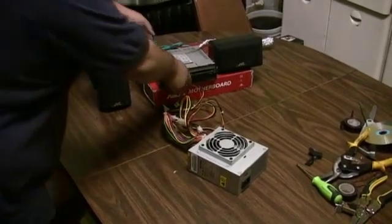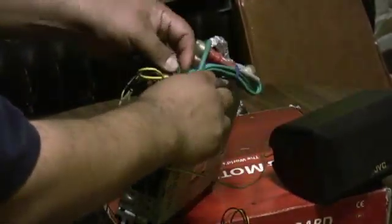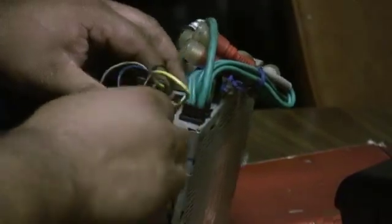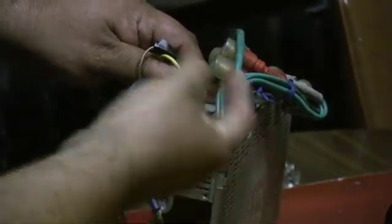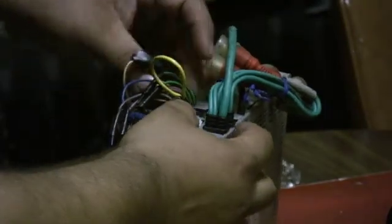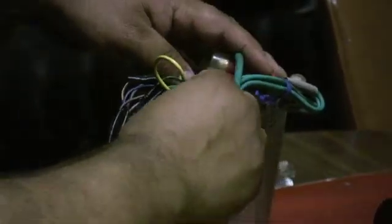In the back of the stereo there are various power and speaker connectors. If you look here, there's a yellow wire, a black wire, and a red wire. This is an Alpine — the yellow and red wires are for power and continuous power from the ignition. You need to tie those together, and the black one is the negative ground wire.